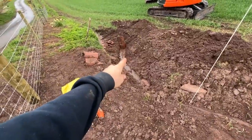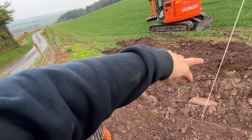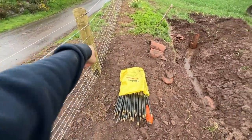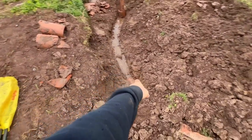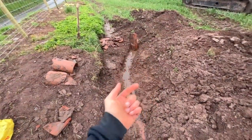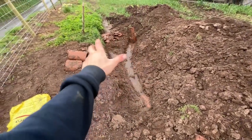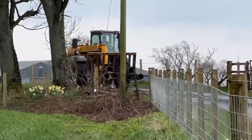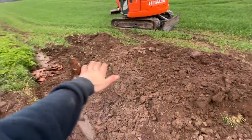We've got another drain we've been in at. When the guys were putting the fences up here they drove their tractor machine up the barley, nailed that stake in, and then all of a sudden there was water bubbling up in the field. We thought something had been hit — what had happened was they'd come up with the tractor and it had obviously crushed a tile and choked it, so it was bubbling up. We checked it the other day — it wasn't a burst pipe. Kev cleared out the tracks and he's just coming down with some tiles.